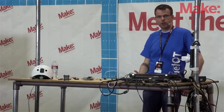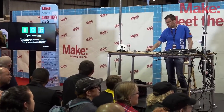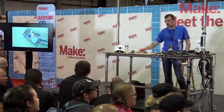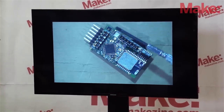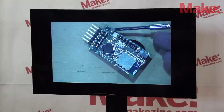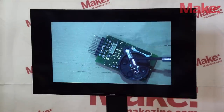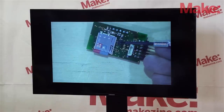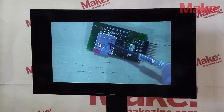We want to make it open to everybody to replicate. We did all the soldering of the unit in our fab lab. This is the guy I'm talking about — it's wearing a Bluetooth Low Energy module, which is a certified one. It uses the ATmega 328 processor. Here you can use the FTDI to program it, and here you have breakouts for the displays. You can see the barometer and the humidity sensor. On the back side is the coin cell, and underneath the coin cell is the accelerometer. We also have an optional GPS — GPS isn't really used for wearables, but if you want, you can hook it up.